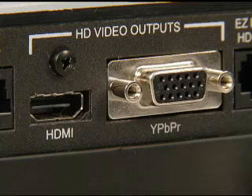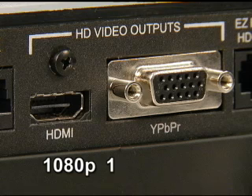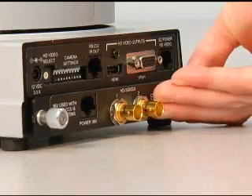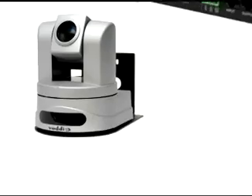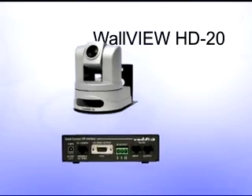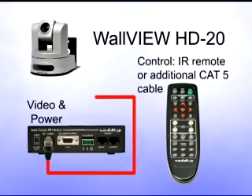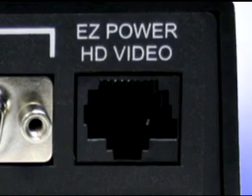Outputs include high definition video in both analog component and HDMI formats in resolutions of 1080p, 1080i, and 720p, ideal for use in presentation and video conferencing environments. HD SDI is also available with an optional slot card. The HD 20 does not support standard definition resolutions. The HD 20 can be configured as a wall view short range or wall view CCU system. The short range system provides power to the camera and component HD video back to the quick connect interface up to 100 feet over Cat5 cable.